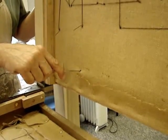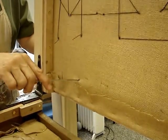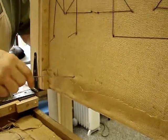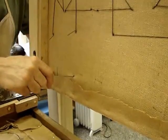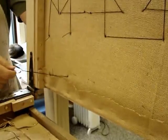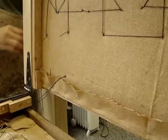We're lashing the coil springs from the seat onto the webbed deck. When you get a shot of the front side you'll see the jute webbing. What I'm doing is sticking a very long needle through the burlap scrim and the webbing, going over the spring orbits in four different positions.